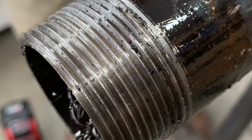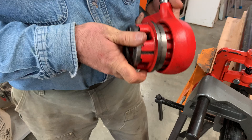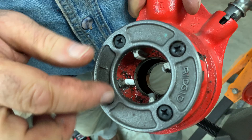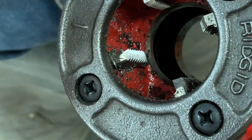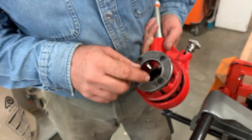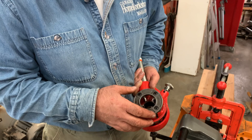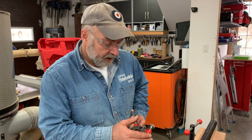If you've never worked with pipe threading dies before, you should know the cutters you can see in here are replaceable. These screws come out, the ring comes off, and the cutters can be replaced — about $40 or $50 for a new set of cutters, and they should last a very long time. The risk is that they break rather than wear out, at least in my experience. So lots of cutting oil — that's the key. And now you're all set to do some pipe threading of your own.